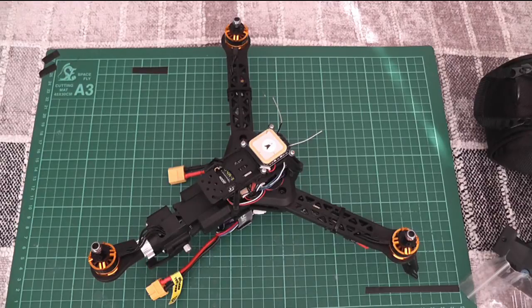I later found out that when you do the shorting as indicated in the documentation for the flight controller board, channel five is the one that the CPPM should come in on. So I might try that at some stage.